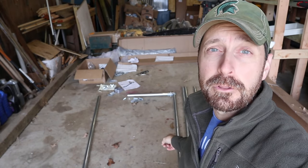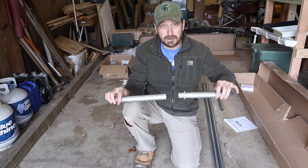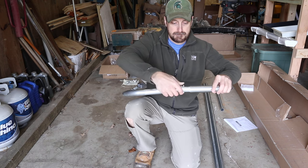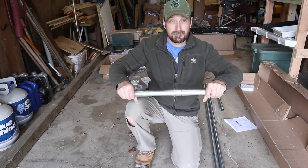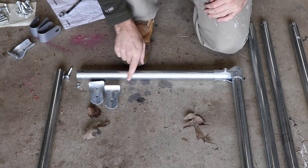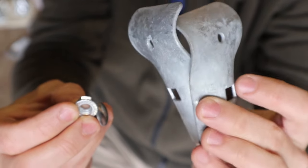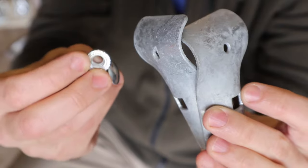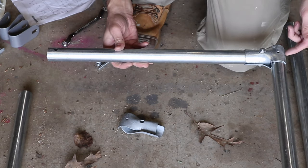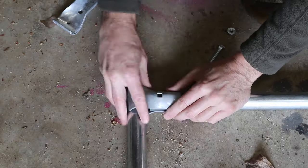Now it's time to assemble the door. This door is easy. It's just got three parts and two connectors. Basically, these two snap together. And those parts you saw me assemble are parts A and B. The short bottom one is for the bottom of the door, and this is part C. To attach the bottom threshold of the door, you'll need four of these clamps and two of the 12 millimeter carriage bolts. And this is how it goes together. It just goes over the outside jamb of the door and clamps and holds it in place.